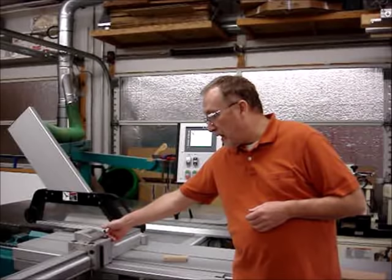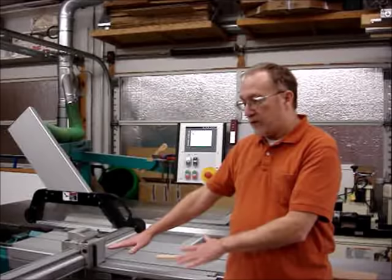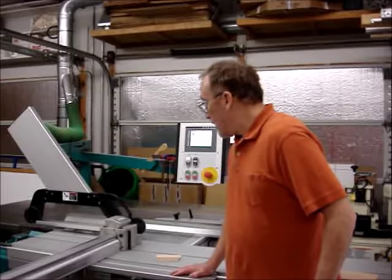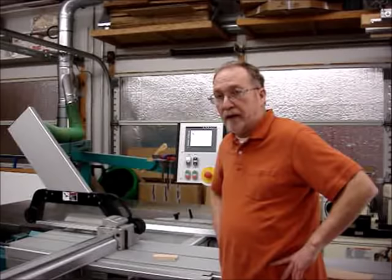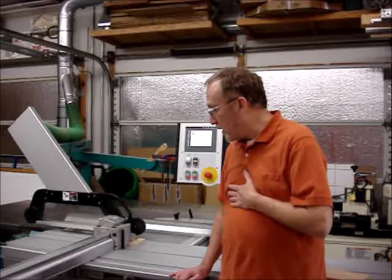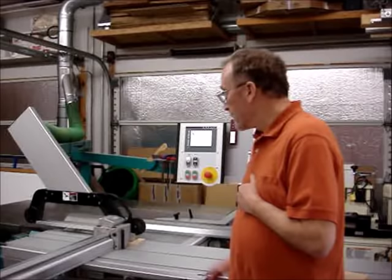One of the examples is this particular slider has a two-point contact fence — two points here — and there is a continuous contact which would basically be flip stops. As an example, the shortest piece that I can get is 194.5 millimeters long between the stop and the blade. If you want to cross-cut anything shorter than that, you're basically dealing with spacer blocks, which makes things much more complex. 194.5 is just shy of eight inches.